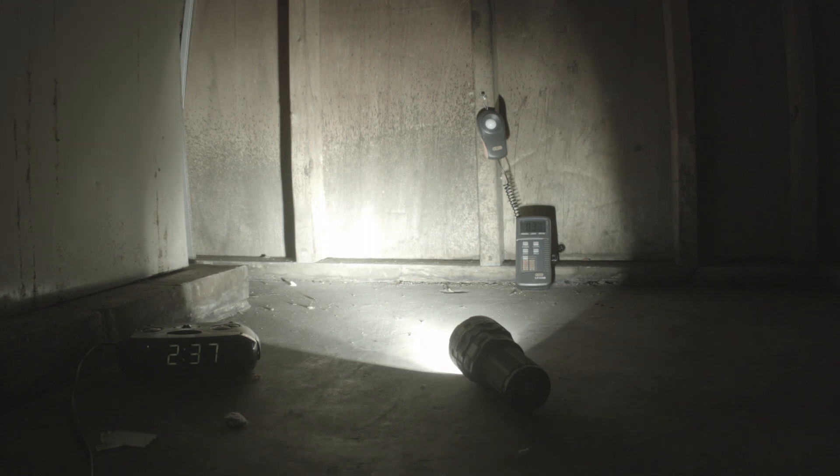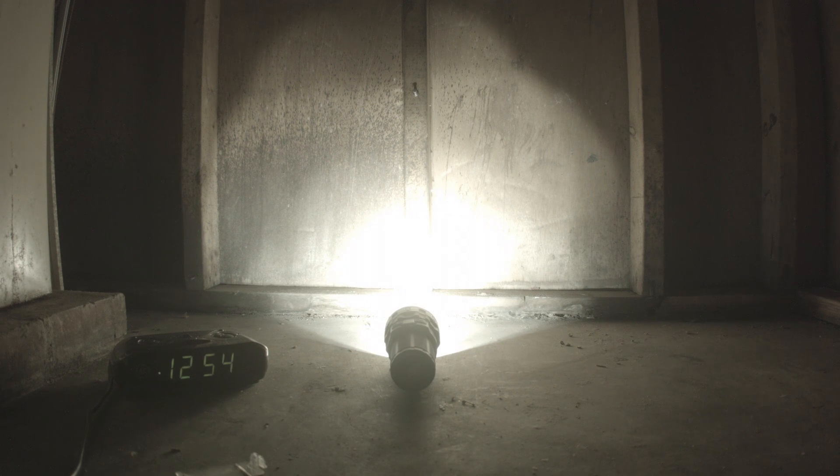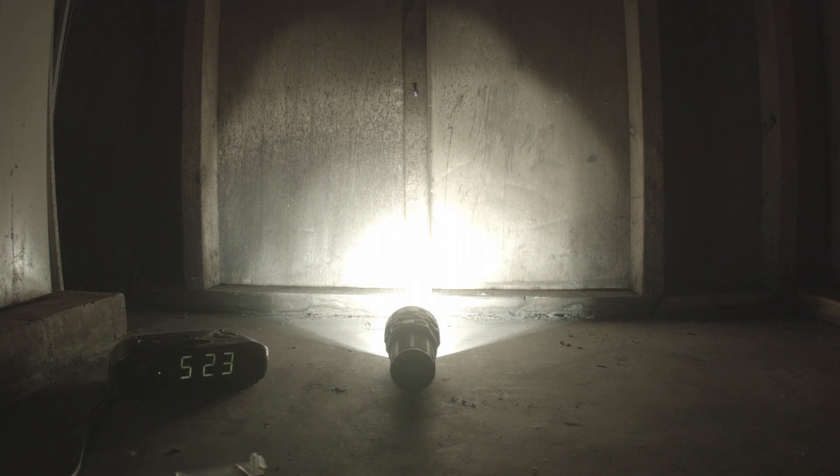Ending battery voltage was about 2.86 volts per battery on runtime tests — nothing below 2.5. On medium, I didn't have the lux meter in frame as the batteries were already spent from prior tests. The light dims slowly over the course of 7 hours 37 minutes before it finally cuts out.